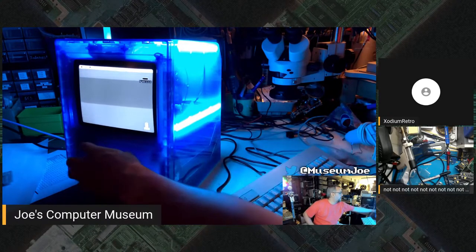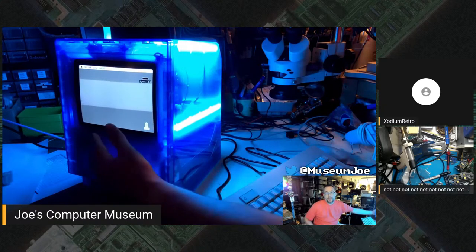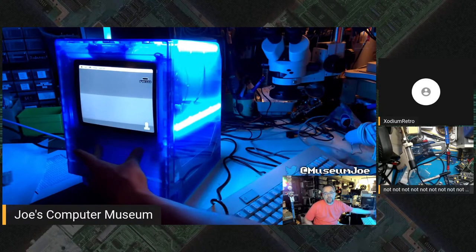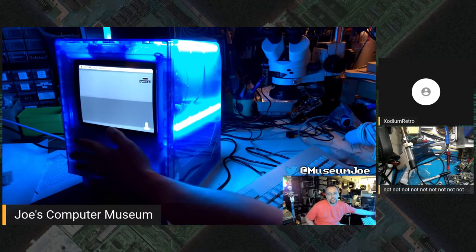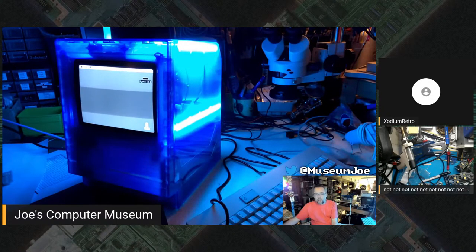And I almost think we need to somehow put some sort of glowy thing here anyway, even though it might be up in your face. We can power that one separately on a higher value resistor so it's not as bright. But this just disappears, right? We need something in there. So we'll see. I will connect it directly to the high voltage output of the flyback, and we'll see what happens. It's going to be a Boo Berry Macintosh this Halloween.